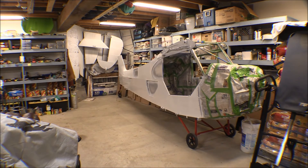There's the fuselage - home sweet home, right back where it's been for the last three years. That won't be the last time it's here because we'll take it down to put the finish coat on it, then bring it back up to assemble all the pieces we've been building. But it's up here out of the way now, letting the polytone cure. I'll take those control surfaces down to the paint booth, squirt some polytone on them, then bring them back up to cure - I'll do about three at a time so I have more room to work around them.